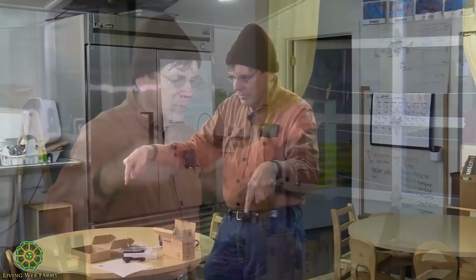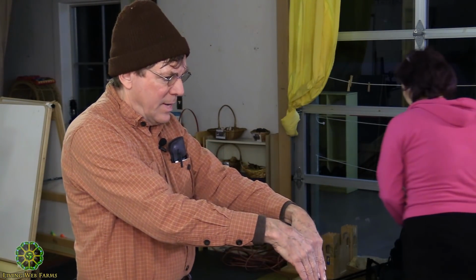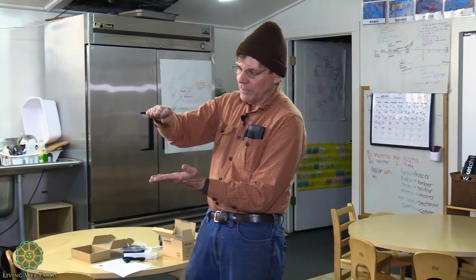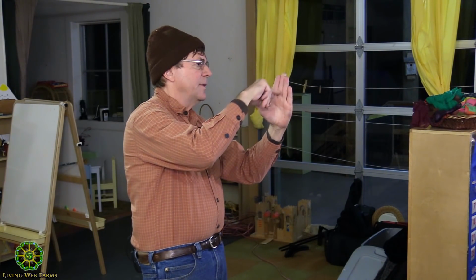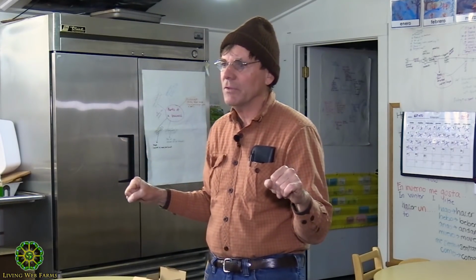So what I've done is got just enough of that to deal with the corners of the chamber. The bottom of those 4 posts are going to go in the water, so that was the whole purpose. And then there's a framework around the back and the sides and the front to hold down low, just a little bit above this 6-inch line where the top of the pan is. And that is 1x6s, which is actually 3/4 by 5.5. That band goes around the bottom. I put in stainless steel bolts and short pieces of angle iron to gusset or strengthen the corners. So basically I have 2 pieces of material in the form of a corner, and then put angle iron in there and bolted it, and it doesn't rack. I mean, it will if you lean into it, but it's fairly tight.